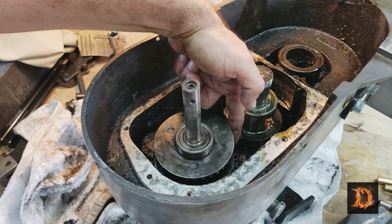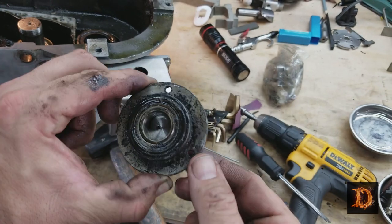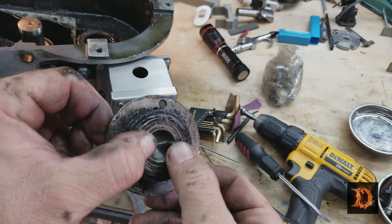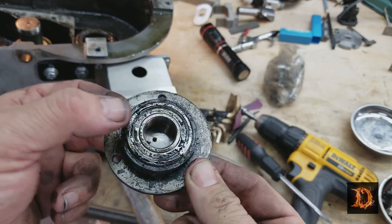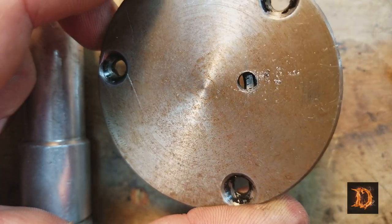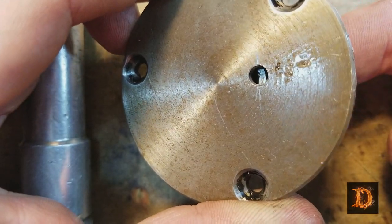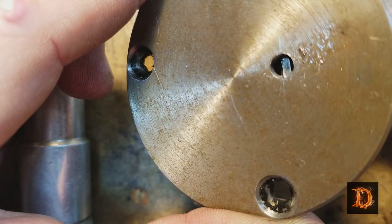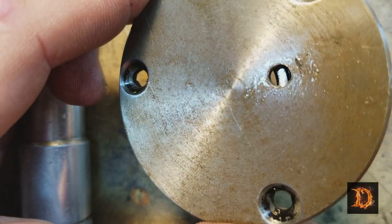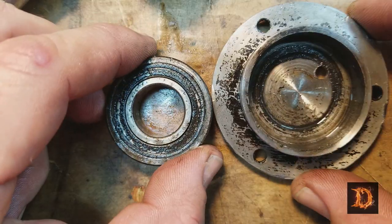There's a bearing here, one in the middle, and one on the bottom. Okay, here's that bearing cap. That's on the bottom. We saw that earlier. And the shaft fits here in this bearing. This bearing here is shot. We'll have to figure out how to get that out of there. Okay, in the end, I drilled it. There's that part of the bearing we talked about before. Right there. That's a number 7 drill for a 1/4-20 tap. So I'll punch that bearing out, we'll tap that, and we can plug it with a set screw. Okay, it came right out.